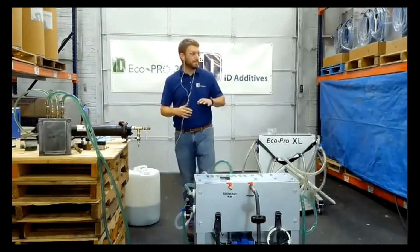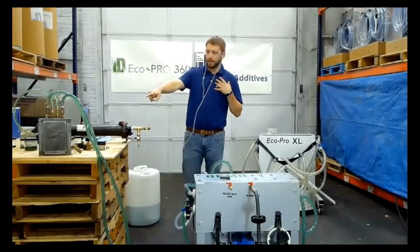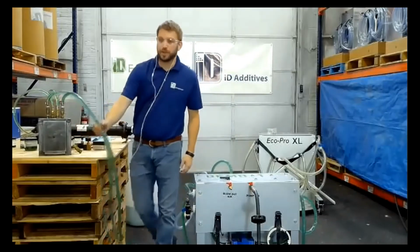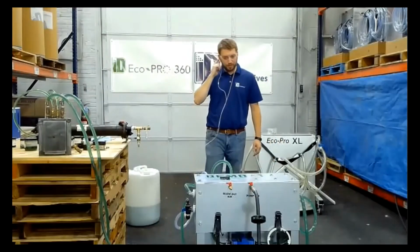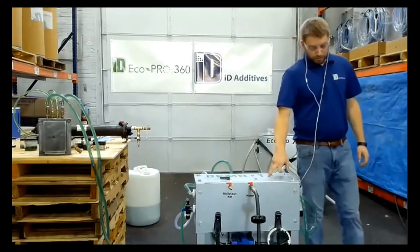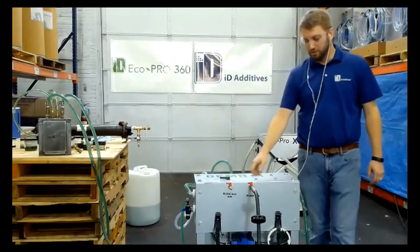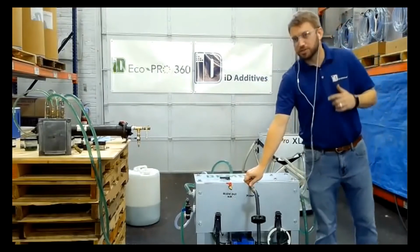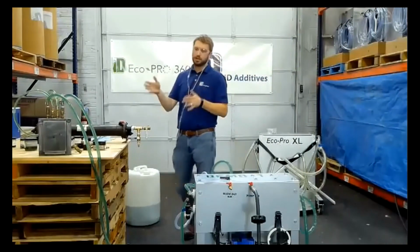While you're free to roam around the shop, do some other things, or work on your PM, there are a few key things you want to watch. Obviously, do a visual check and make sure it's not leaking anywhere or even outside your tools. You also want to check the color of this chemical. This is kind of a translucent green. The other thing you're doing as you work around the shop is listening for audio cues. Earlier, when I was hooked up to that heat exchanger and recreated that pressure block, you heard the pump slow down and the cavitation stop. So visually or audibly, that should tell you when you're working elsewhere that there's a block in there. So you just want to keep an eye on her. That tells you, hey, you need to pay a little bit more attention.